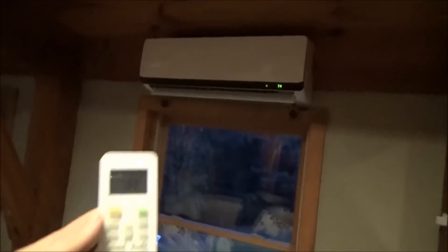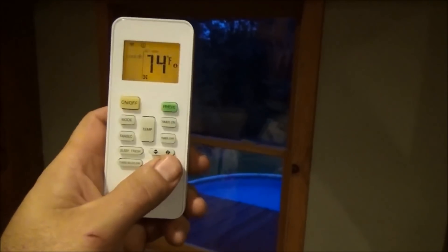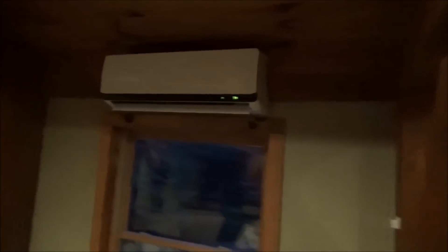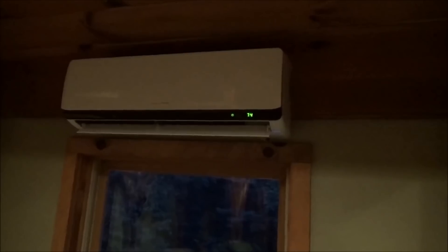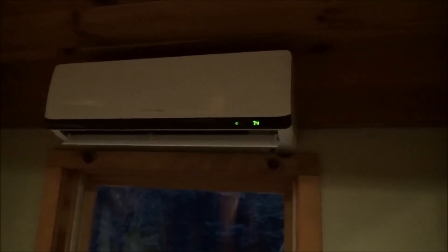Here's the indoor unit. It's got a nifty little remote with timers and all different settings. It's a heat pump, so it will do heat and air conditioning. It has a 'follow me' mode — wherever the remote is, the air conditioner works to satisfy the temperature at that remote location. This unit is working great. I put it in the worst place in my house in terms of heat — up in this loft — but now it's actually an enjoyable space in the hot summer because of our solar-driven air conditioning. The ACDC-12B is the model. You can find it at practicalpreppers.com under products and air conditioning. Let me know if you have any questions — so far, so good.